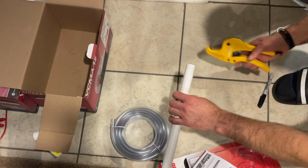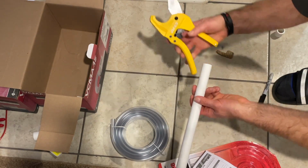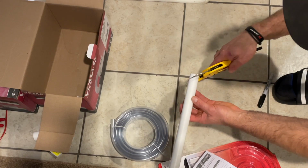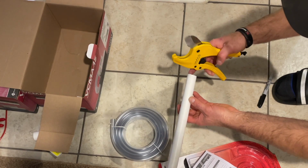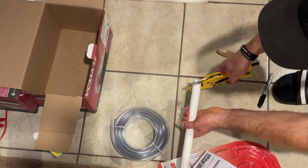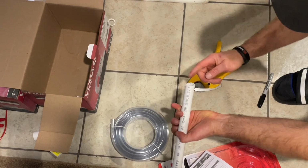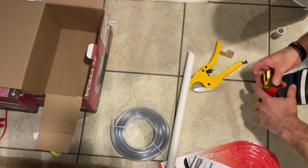So we're using 3/4 piping, just like the rest of the setup. Got my pipe cutter. I'll put a link below to this one. This one's awesome, heavy duty. It was only 12 bucks. And you want to do a 45-degree angle because the pipe has to sit on the bottom of the pump floor, but you don't want it sitting flush, closing itself off. So that's what we're doing here. There we go. And we'll just measure the rest and install it.